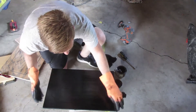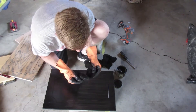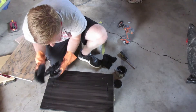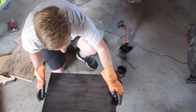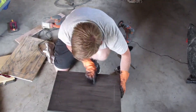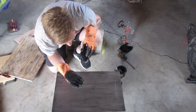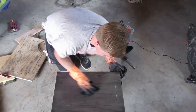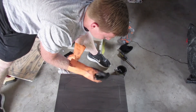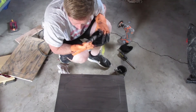You're going to want to take the stain off going with the grain, and you're going to want more than one rag. Use a dirty rag for the first few wipes, then a cleaner rag to give it a finishing touch. Try to avoid touching the surface as much as possible because you'll leave fingerprints that are more difficult to get off. Set these somewhere to dry where nothing is going to fall on them - once something falls on the wet stain it's almost like a glue and really hard to take off. I'm going to put these outside to dry.